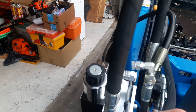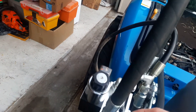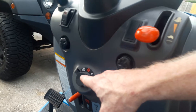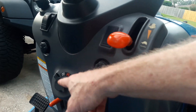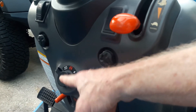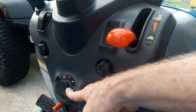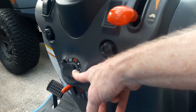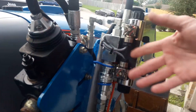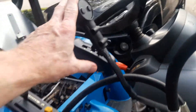I managed to route the wires down through here — these are the wires that control the valves. They run down through and up underneath the cowling of the tractor. I ran them over to my hot switch here and spliced into the switched side of the ignition. Most ignitions are going to have two wires that are the cold side and unswitched power coming to it, plus a hot and ground lead, and then two going out that have the switched side of the ignition. I spliced into those two lines and that lets my third function work.